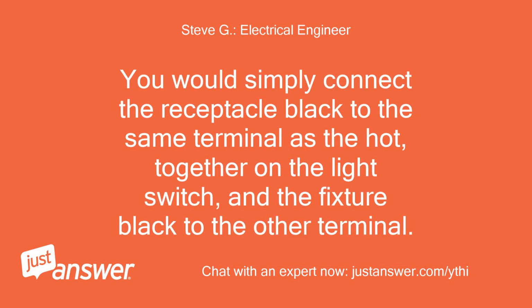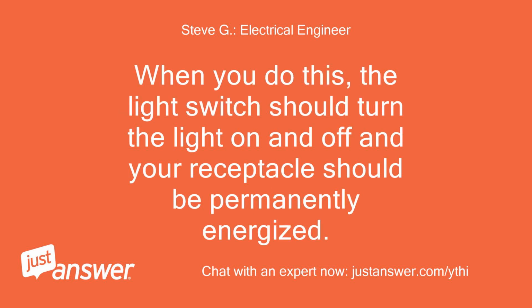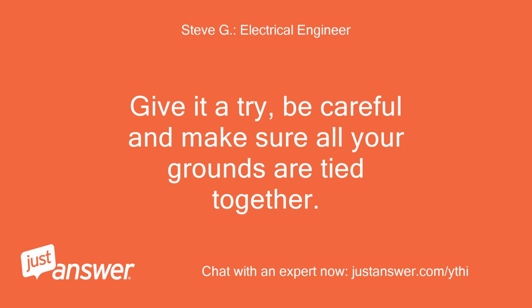You would simply connect the receptacle black to the same terminal as the hot, together on the light switch, and the fixture black to the other terminal. When you do this, the light switch should turn the light on and off, and your receptacle should be permanently energized. Give it a try. Be careful and make sure all your grounds are tied together.